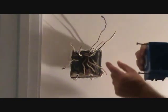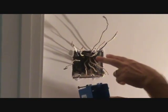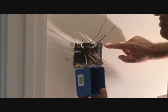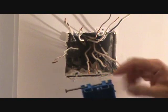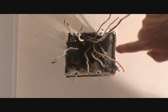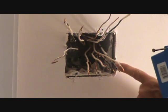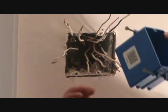Okay, this box is mounted to the stud here. This is just a single gang box — it looks just like this except this is a double gang box. You see the nails here — these nails are nailed into the stud. So what we're going to do is slip a hacksaw in there and cut the nails off. You can imagine these nails going into studs. I've already cut this back just a little bit, shoved a screwdriver in there, got a little bit of a gap. I shined a flashlight in there to verify there's a nail right here and there's a nail right there. So we're going to shove a little hacksaw in there and cut those out so that we can pull this box out.